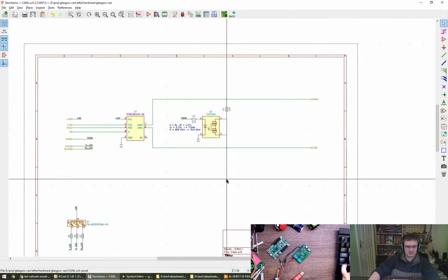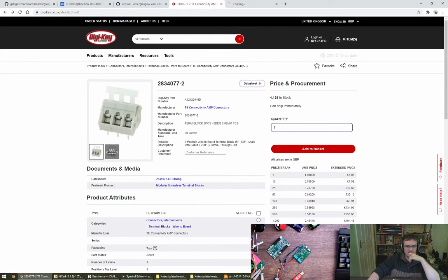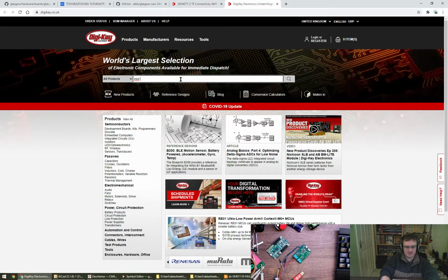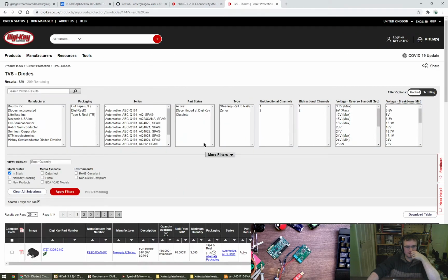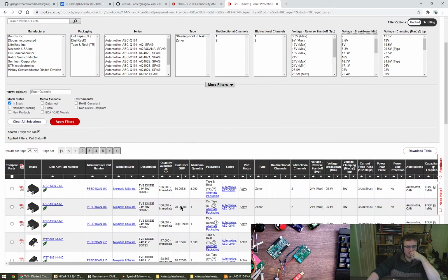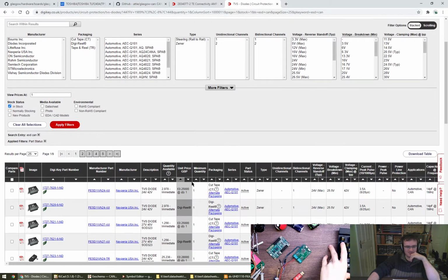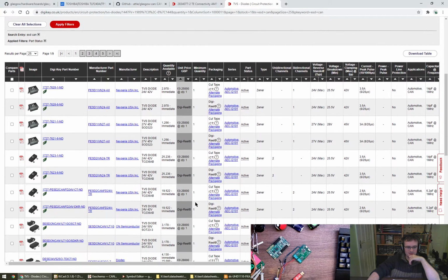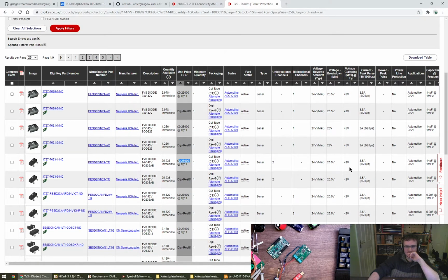And now we want some ESD protection. So ESD wise, I'm probably going to get a clobbered ear from Esden for looking on DigiKey again, aren't I? ESD CAN, I think, will give us something. I think this might be the one I've used previously, actually. So let's do one off small cost first. He's only concerned about wallet, that's true. So we got 28p, say, for a single part, which will do both sides. It'll clamp it to 42 volts, which is quite a lot.